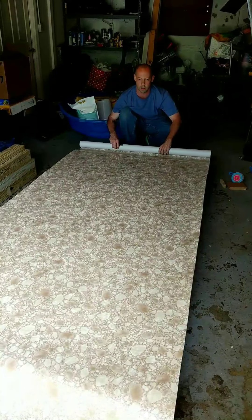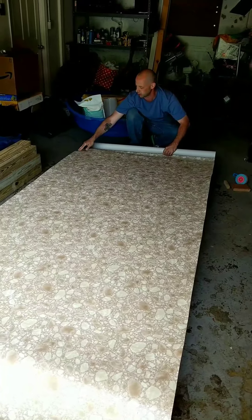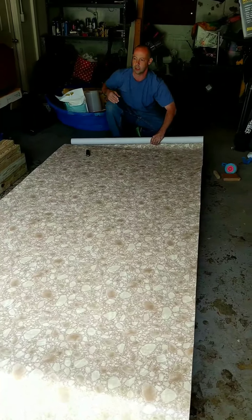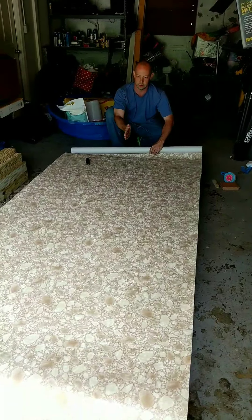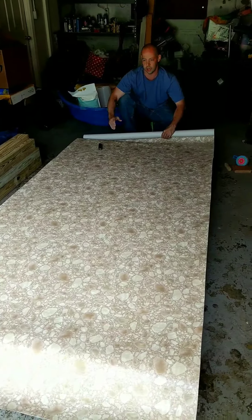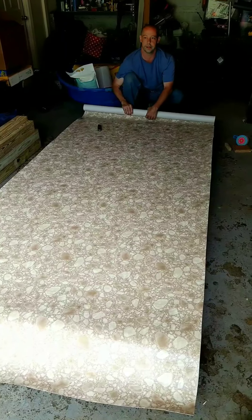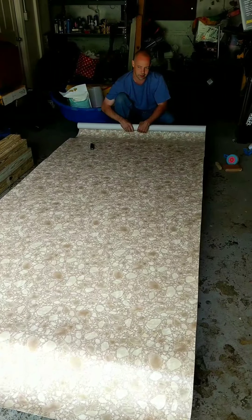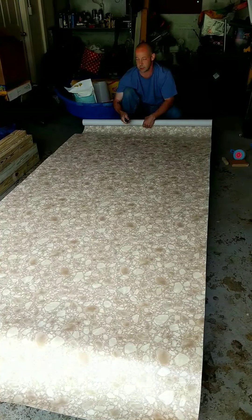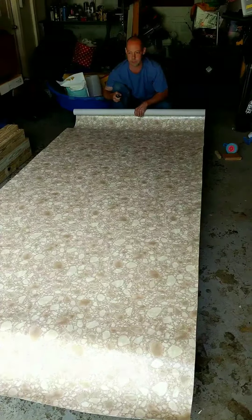So I think I'm going to leave it overhang so the weight of it will drape down, and then we'll cut to fit after it's glued, because we've got to roll out any bubbles and things like that. We're going to smooth it out. I'm going to take the four by fours and actually use them. We're going to start in the middle, I'll have Kim help me — press down, slide one that way, press down, slide that way, then lay them all on top to keep it from curling up and let it dry. Temperature's supposed to be raised and there's other things you're supposed to do as far as temperature, but we don't care — it's for chickens. We just want to make sure it stays glued down.